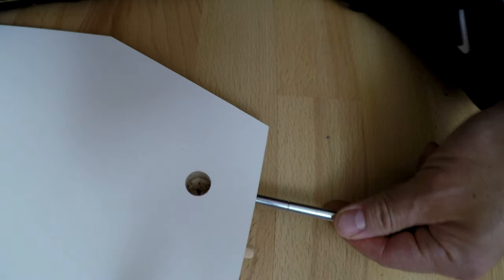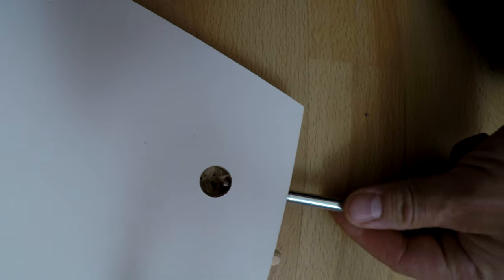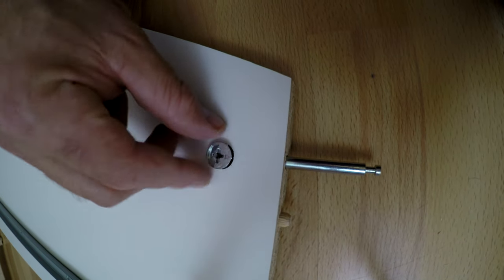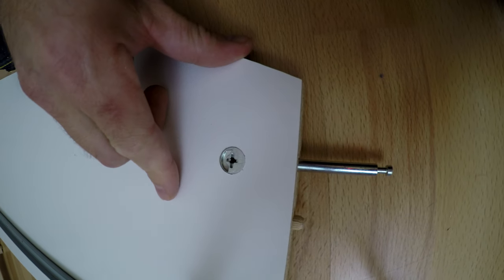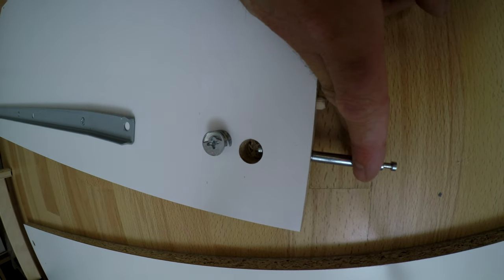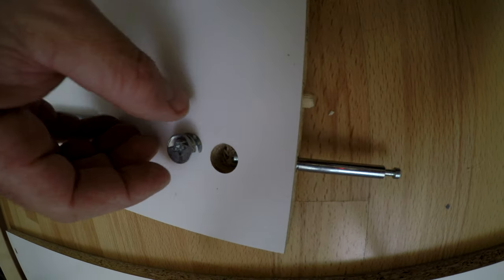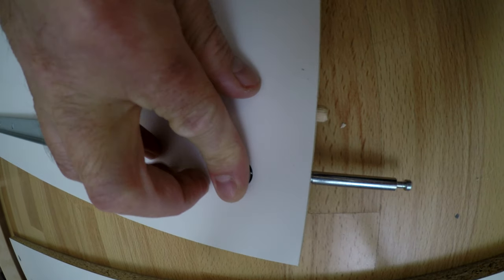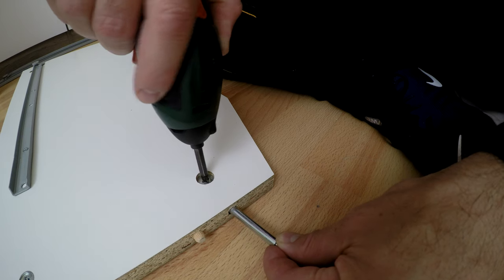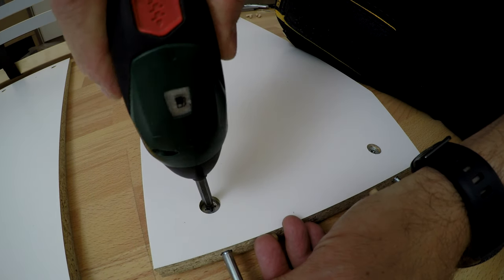Go all the way with the screw — there's a small grip in one half, so just tilt to the grip. The grip should be on the edge of the board, with the head sticking out just slightly. Place the cam lock in and don't forget to point the arrow in the right direction — the arrow faces the screw or faces the hole. Go till the edge of the panel, place the lock with the arrow facing the screw, and twist to the right — just one quarter turn. Not all the way, just one quarter for now.